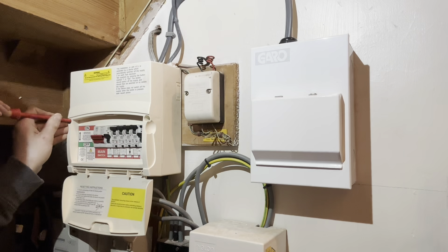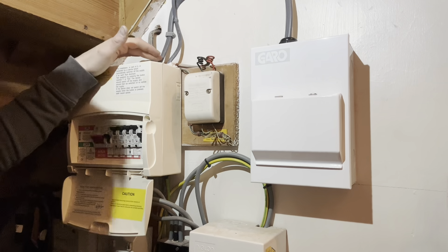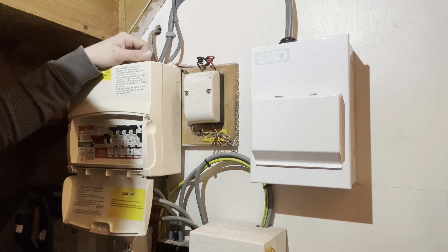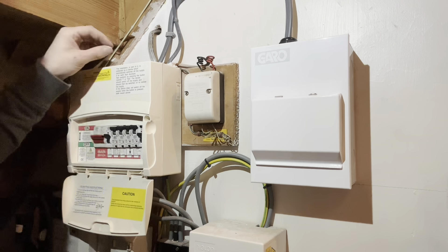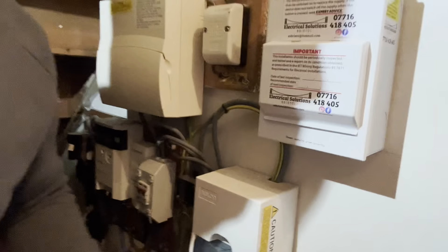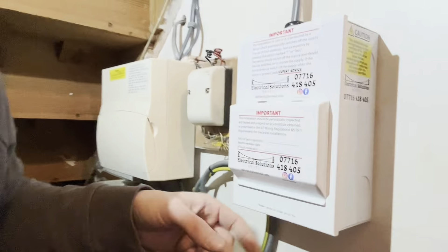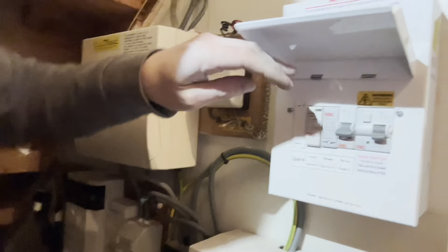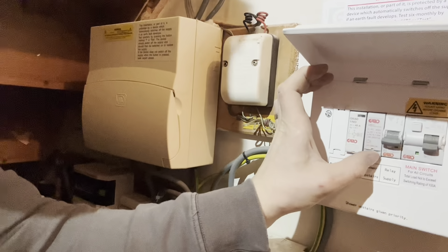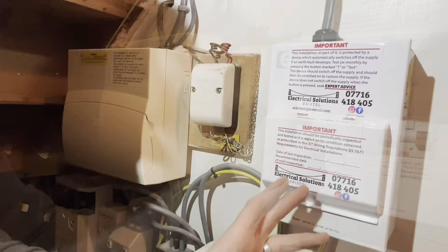Right, putting the cover on. I've put a couple of cable clips in at the top and some fire sealant - I don't normally agree with it in the back of consumer units, but these square knockouts had been smashed to get cables in, so I've touched it up to maintain the IP rating. Labeling done: shower supplies, shower upstairs given priority, relay supply, shower upstairs, shower downstairs. A bit over the top but the client will never know what this unit is without it.